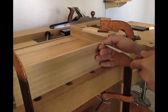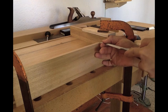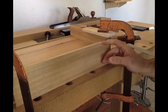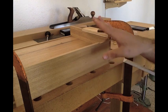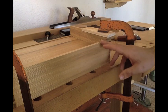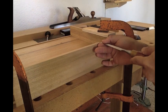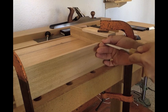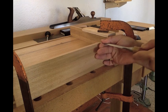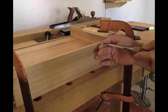Cut here so that the hinge is clean and you don't see any gap at all. It's possible also that I'm not going perfectly flat on this, and maybe there is a small angle, that's why the hinge is proud. So let's try to go deeper, and not push too much on the ridge, otherwise you can break it.